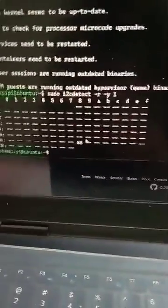The communication between the Raspberry Pi and the MPU-6050 is I2C, and its address is 0x68.